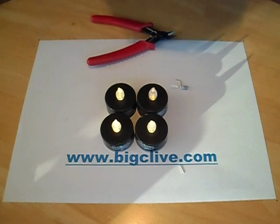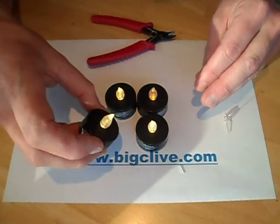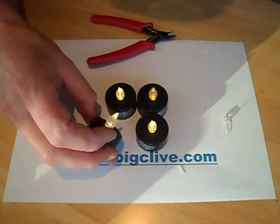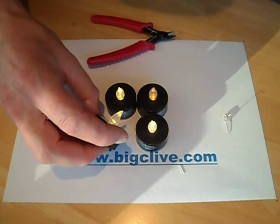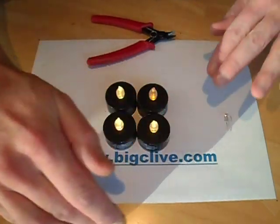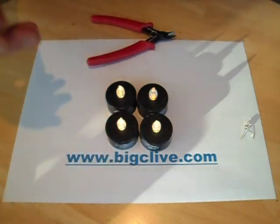You wouldn't think the batteries would last all that long, but they seem to last ages. As the battery voltage drops, the LED draws less and less current. Keep in mind these are 3-volt button cells and the warm white LEDs themselves are rated at a maximum of about 3 volts, so as the voltage falls, the LED just gets a little bit dimmer. As it does so it draws less current, giving you a curve of brightness that lasts for days — you could probably come back after a week of continuous operation and it would still be glowing quite brightly. Just a little holiday hack!